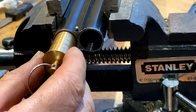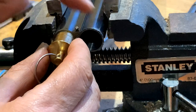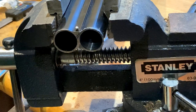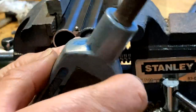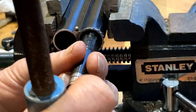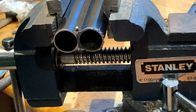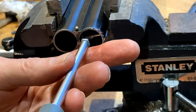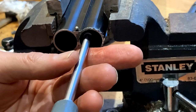This one's still at quarter. So this will go to cylinder. Cylinder and improved is the plan. And we're through. It's important to go all the way through the choke, otherwise you'll end up with a sort of weird taper thing going on. It's tight, but it's good. You don't want it loose, do you? Yeah, there was less cleaning up on that. I think that one, yeah, that's good.